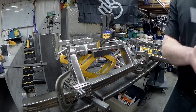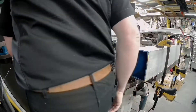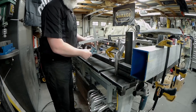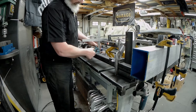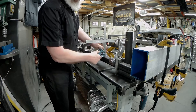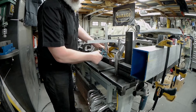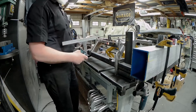Now we know that we're the same height off the jig. We go quickly over to the other side — we haven't moved anything — and once again we're dead on. We're right on it, just able to scratch the top of that rod. So these laser cut parts are pretty good.